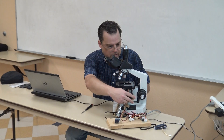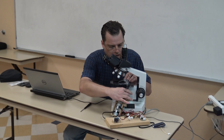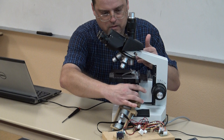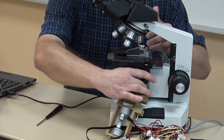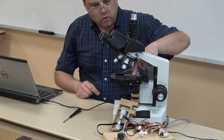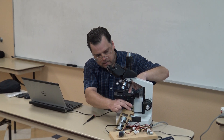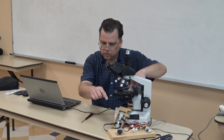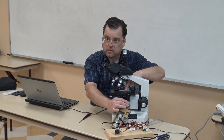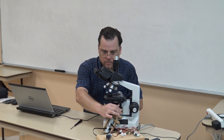I can record that, and my microcontroller knows where it is on the slide. When you start a new slide you zero it — set your Y all the way over here, X all the way over here, so we always have a starting point. We drop the slide in — this is the origin — and as the microcontroller tells the motors to step, if we've told the motor to go 10 steps we know exactly where we are on the stage. It's repeatable, which you can't do with a regular motor.